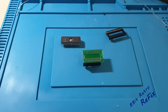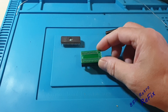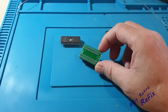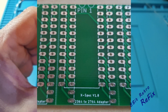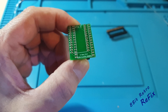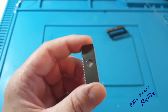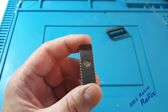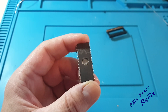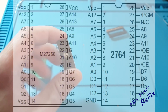Hi, welcome to another episode of 8-Bit Retro Refix. On this week's episode, I'm making some ROM chips - some basic ROMs for the Commodore 64 longboard. What I've got is these little adapter boards. These convert from the original 2364 to a 2764. The 2764 is the same as this EPROM, which is a 27256. I've checked the pinouts and I'll pop some pictures up so you can have a look - they're pretty much identical.